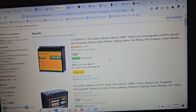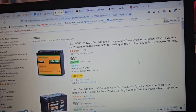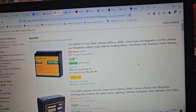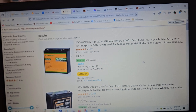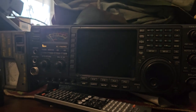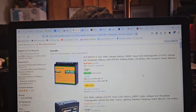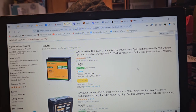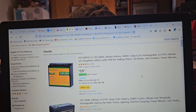An HF radio does not pull 20 amps on single sideband — only on voice peaks, some do. The average draw you're going to see on most radios that you'd take out for portable work is going to be about 12 amps. Most of the latest radios are kind of anemic. They're not going to be like this ICOM here that puts out 125 watts on sideband peaks. It's a 100 watt radio, but it gets after it. If you use something like a 7300 or a 710, most of those radios are not putting out a full 100 watts. They weren't designed the same way.